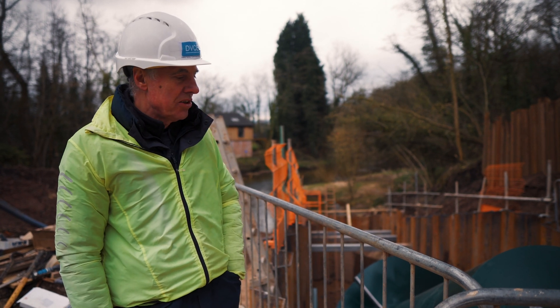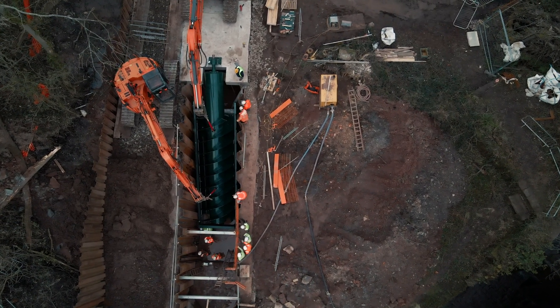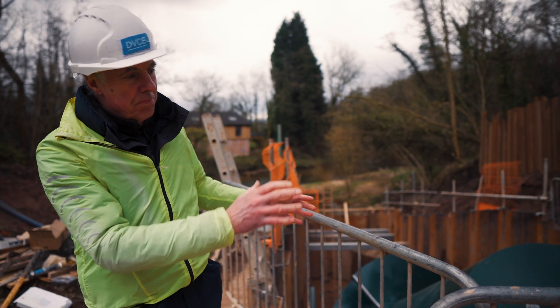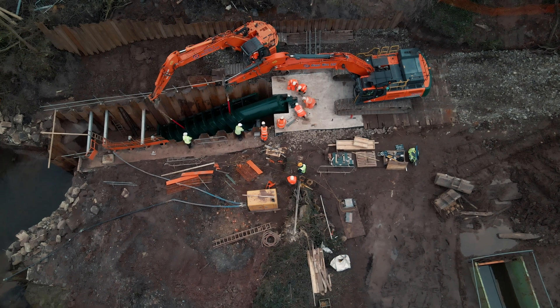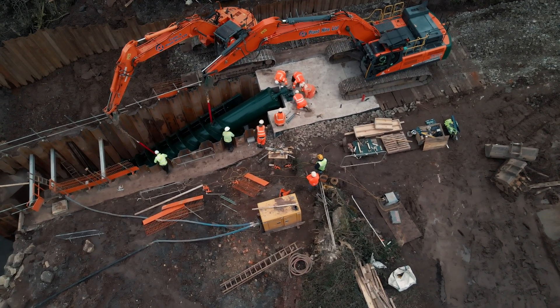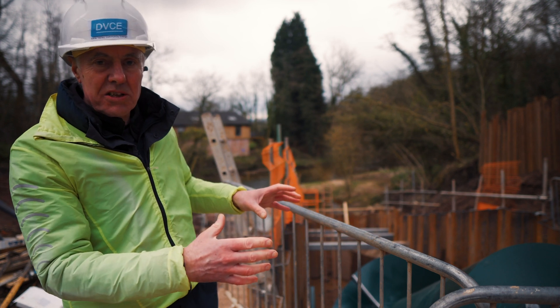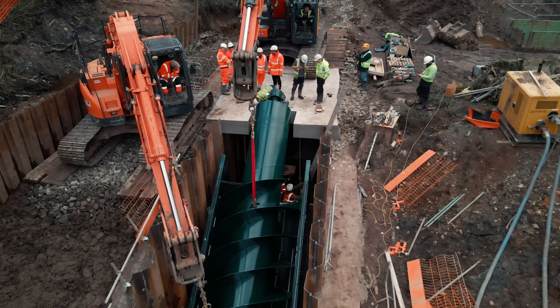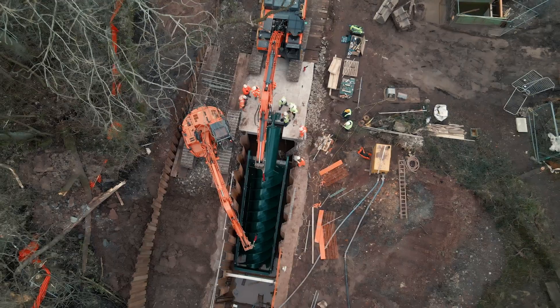The next phase of the operation is to fix this top plate more solidly by applying a grouting material underneath the plate, so that it's more solidly locked into position. Then we'll take out the protective struts at the bottom bearing, which will allow the thing to rotate. Finally, we'll remove the shims — aluminium spacers currently spacing the flights of the screw away from the trough — by slightly jacking up the two ends of the screw to pull them out. After that we'll be able to turn the screw manually and confirm that everything's lined up.